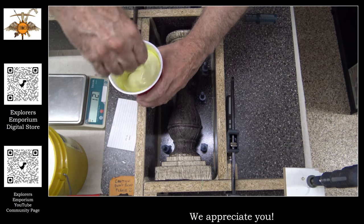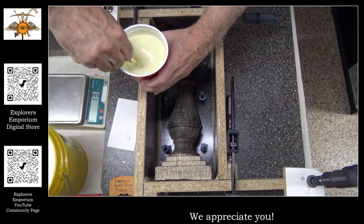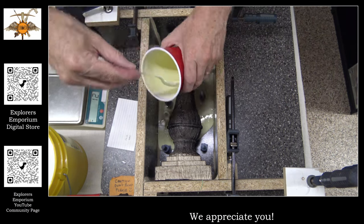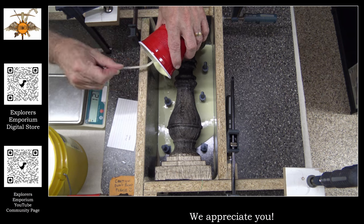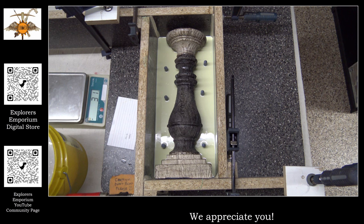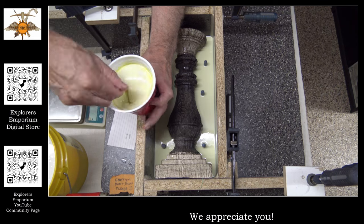We're using smaller cups right now because I have to do a precision pour. The candlestick is pretty simple, so I just have to be careful where I pour — I don't want to pour on the pins or on the actual candlestick. That means I have to mix several cups in order to do the filling process. But the work time with silicone is about 40 to 50 minutes, and this won't take me more than about 10 minutes, so it's totally okay to use multiple cups.